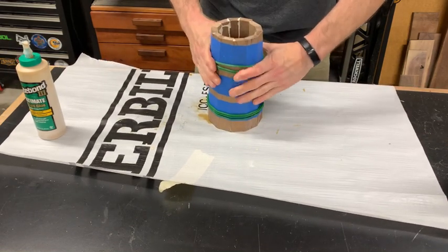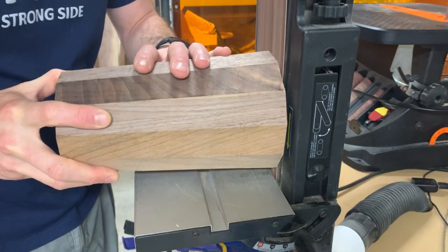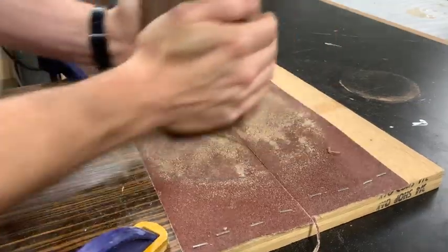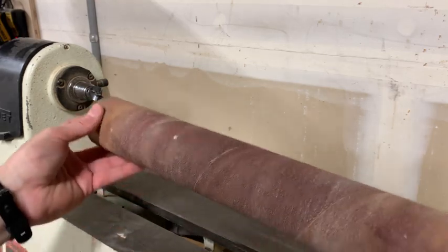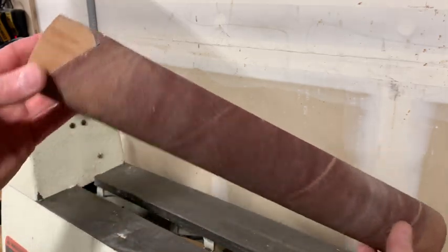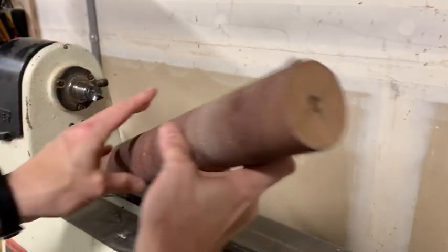Even with the correction that I made earlier, a small bit of sanding is needed to get the top and bottom each flat. To smooth out the inside of each tankard I use a drum sander that I made for my lathe. It's just a piece of wood wrapped with an old 80 grit sanding belt.